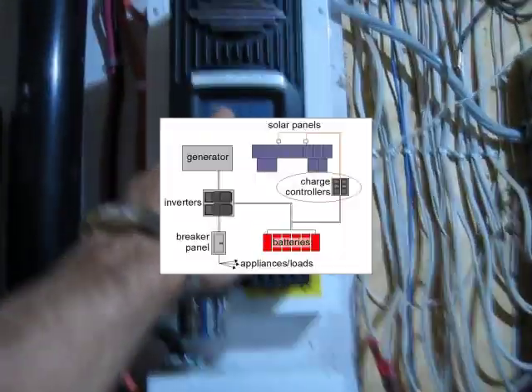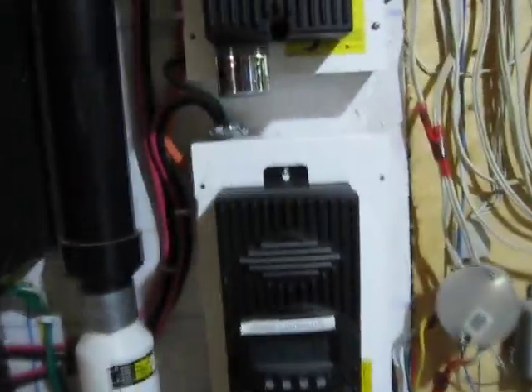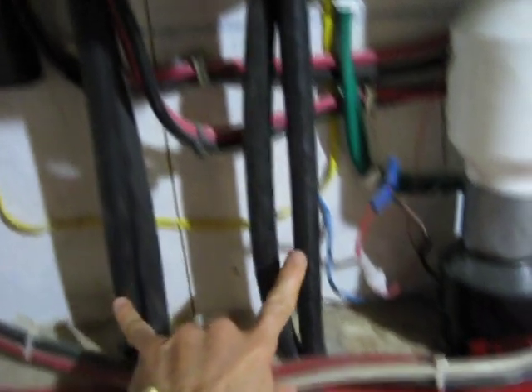So here's the inside. Those two orange wires up there are the ones that come from those two boxes on the roof, and they run down to these two things here. These are called charge controllers — actually labeled right there. You can see the orange wires going into this white box that the charge controllers are bolted to, and the other one down to this one right here. The charge controllers massage the power a little bit, and then you can see the red and black wires coming out, going into this box right here. In this box they're connected to various points and these two big breakers, or disconnect switches. Then they come out in these two thick wires here, which go down to the battery bank.